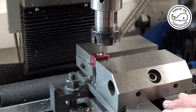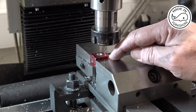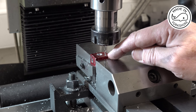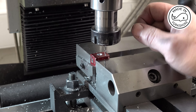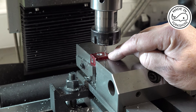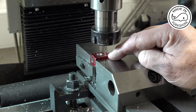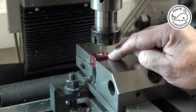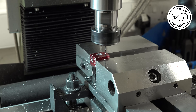This is the point where that fine drill broke when I was trying to drill through with a 43 thou or 40 thou drill bit right through and into the fuel inlet. So what I've decided to do this time is first drill with this 70 thou drill bit to a depth of 200 thou - 0.2 of an inch - because that will be later tapped to 2-56 UNC.